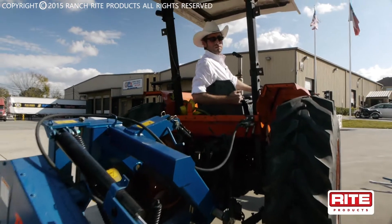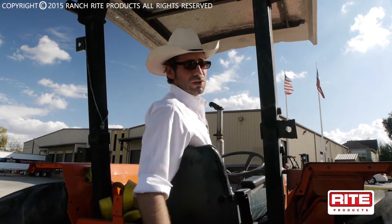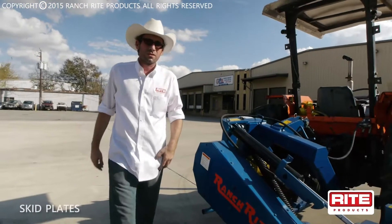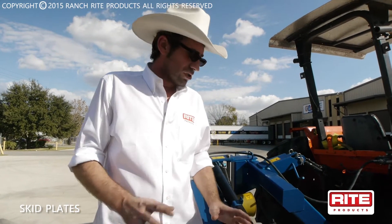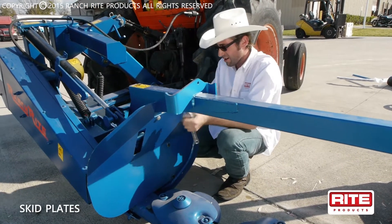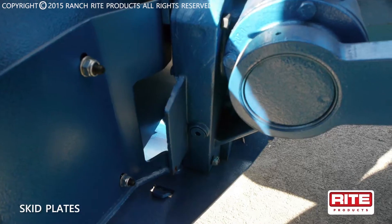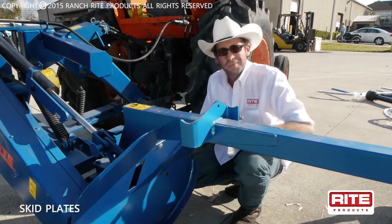Now that you've got your load down and supported on the crate, take real care and pay attention in case your three-point of your tractor starts to drop. Try not to put anything under the implement while you're assembling just to keep everything in line. Next step, we're going to attach our skid plate and our covers to protect the operator. It's not a big deal to do — just a little bit of time. Remember, don't tighten all your bolts up until you have everything assembled. After you get all your bolts tight and your guards on, make sure the lineup is all nice and even. Make sure all your bolts are tightened flush to where you crush the washer or at least the bolt is past the lock nut. Let's move on to putting our curtain rods on.